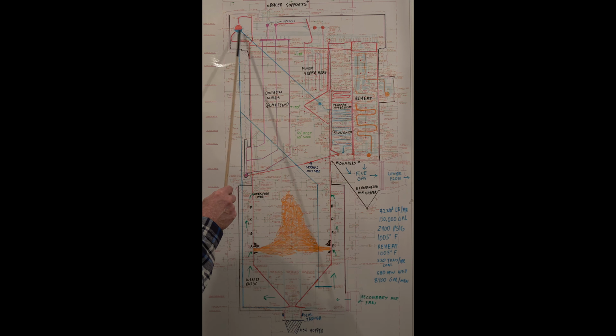Here it's mixed with the water that's went through the boiler pass. All the steam's been separated. They have a vortex breaker that is a screen up here. It goes down 18, 16-inch lines. That feeds your bottom water wall tubes. There's different places it feeds them from.